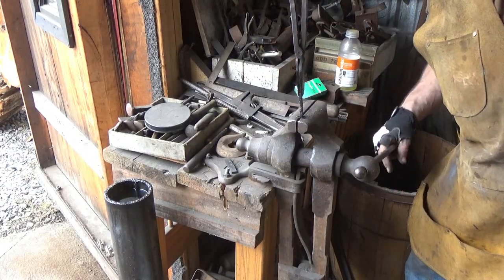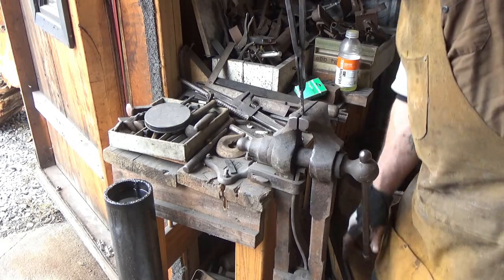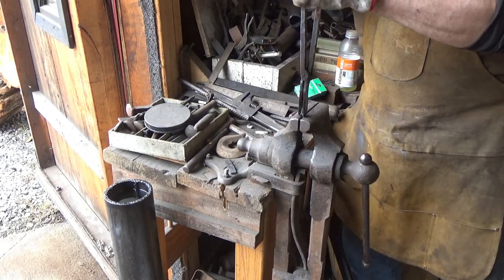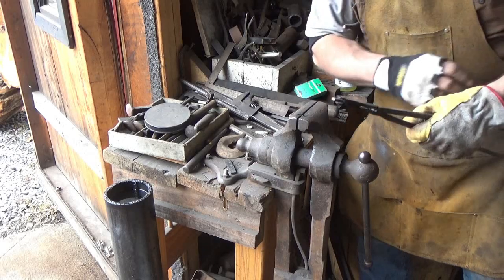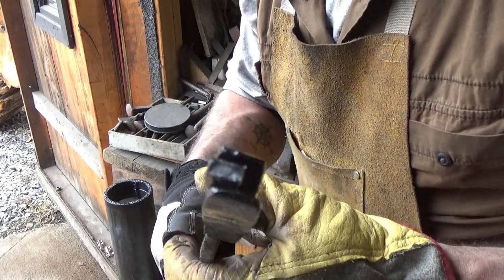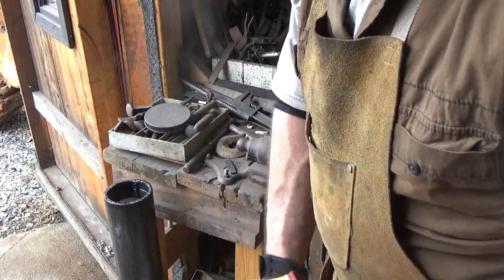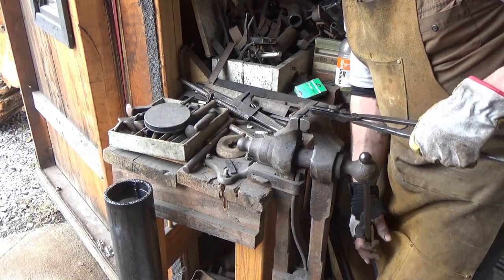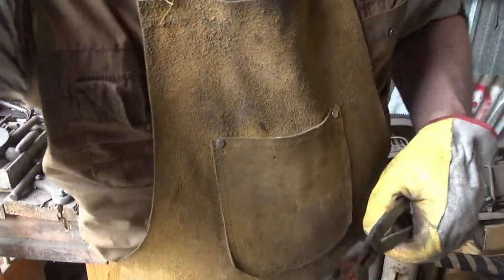Yeah, we're gonna be pleased with this. I'm going to a different spot, a little lower end. And last time, we'll probably just use the tongs. I'm sure it'll work. Oh, all right, she was tough, but she broke. With a really, really fine grain pattern. Tighter than I expected. Interesting. A little different pattern around the outside, too. Well, anyway, we know she's going to take a harden, so we can keep going.